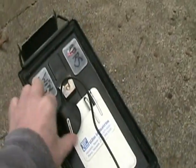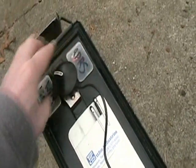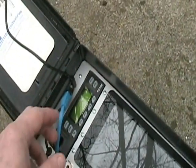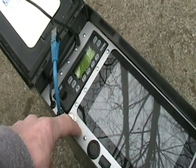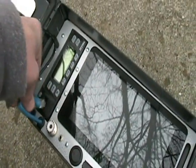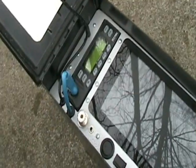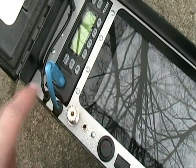What I usually do is just position the GPS unit right on the mic — it keeps it kind of level. I can plug in a microphone and a speaker and do voice. If I want to do APRS or WinLink, just plug in the TNC antenna connection. Of course, that's the GPS right there.